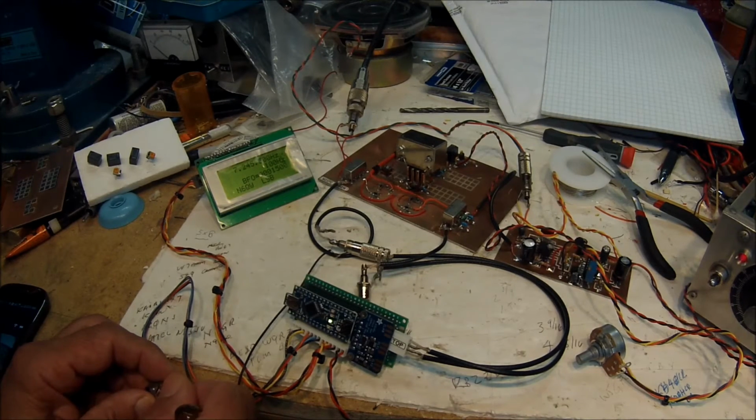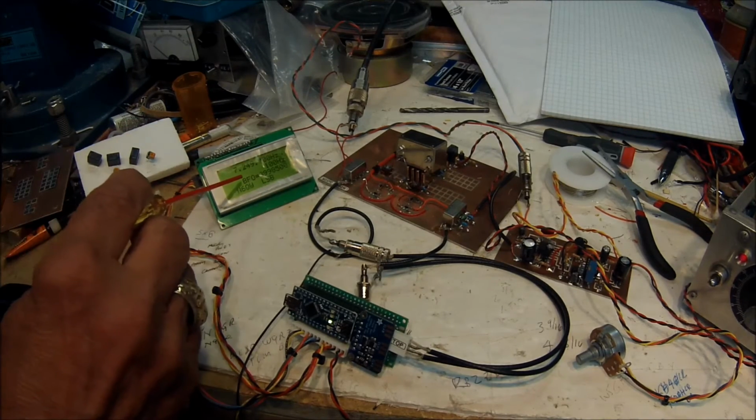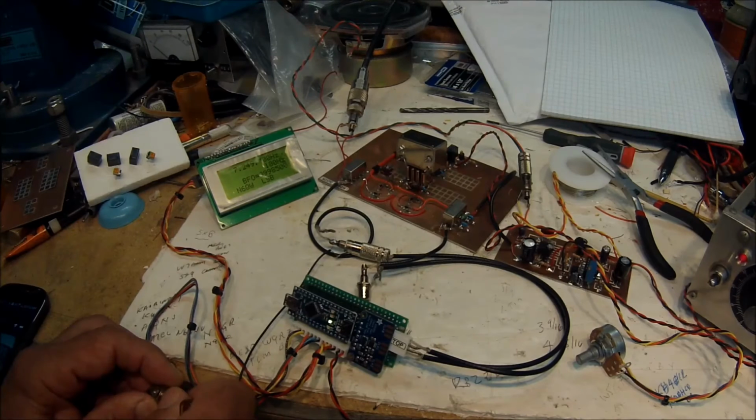So how about that? No crystals. The BFO is now... By the way, the BFO frequency normally used for lower sideband is used for upper sideband, and the upper sideband BFO frequency is used for lower sideband because of the frequency inversion. Okay, we'll turn it back now. But it tells you here, BFO is 8.99850.